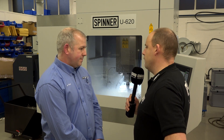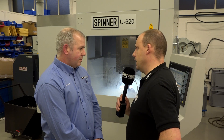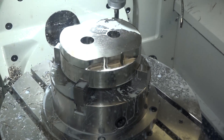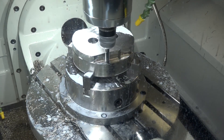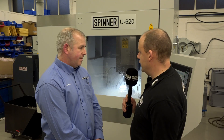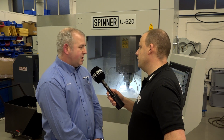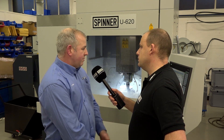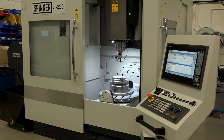You mentioned you're machining at just over 4,000 rpm here, but surely it's a higher speed spindle? Yes, this machine has a 12,000 rpm spindle, so if we need to use smaller tools we have the higher spindle speed available. But as you can see, it's perfectly capable at the lower end too — you can cut at 2,000–3,000 rpm and there's plenty of torque in the spindle, so it really is a very strong machine.